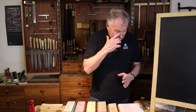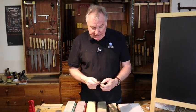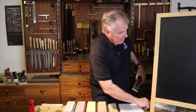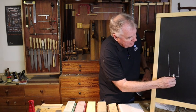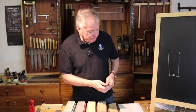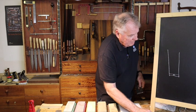Starting with damaged plane blades first — this is just an old Stanley plane blade. It has a ding in the front of it right at the edge, probably caused by hitting a nail somewhere in its lifetime. Looking at this plane blade, we've got a bad ding in the bottom. This needs to be removed, and we've got the primary bevel here.